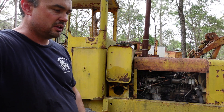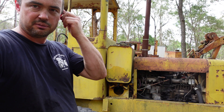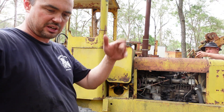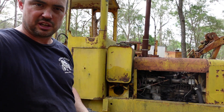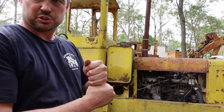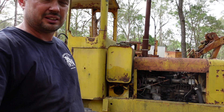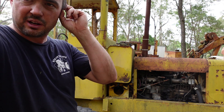What I mean by that is the rod came out through the side of the block. When I went and got it I took the great Kenworth with the little float — you've probably seen the background — and we drove over there, and the bloke lifted it on with a 50 tonne Komatsu excavator and brought it back. When I got it home we poked the oxygen through and blew that rod off. We blew that rod off, took it out, undone the bearing cap, blocked the oil journal off with a bolt and a hose clamp — I still had pressure — and diverted the injector line back into the tank, and we drove it off on five cylinders and used it like that for about three years. When I say three years it was probably only 10 hours work but it still did it, and then it started to get another rattle so I took it out.